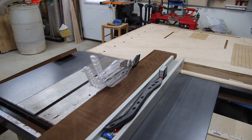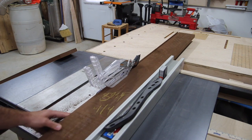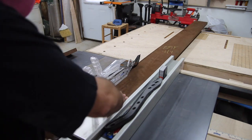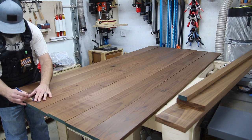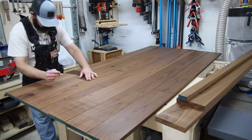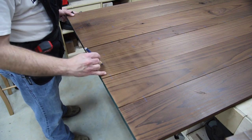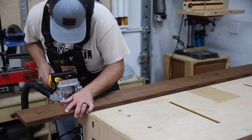This gives me a nice clean slate to start with so I can lay out the boards, see what I'm working with, and get this thing put together. The door is going to be about seven feet tall and about 41 inches wide, so I've got several boards to glue up. I'm laying out my biscuits for the door, and some of these boards developed a slight twist and a couple had a bow, so I laid the biscuits out every six inches and numbered the boards so I don't get them mixed up later.